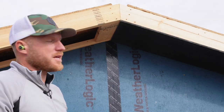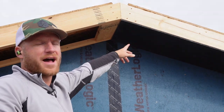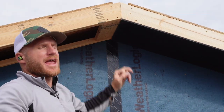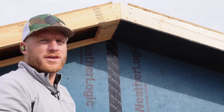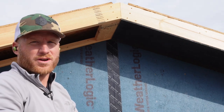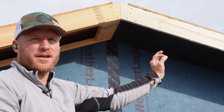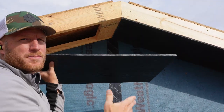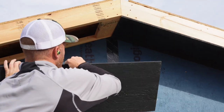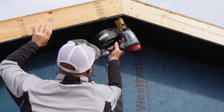Up here at the peak you'll notice we've got blocking on the peak so that both sides have a good nailing place. I'm going to go ahead and just butt the two pieces together and then we'll put a bead of black caulk right there. I wasn't going to miter the pieces because you don't really want to go too tight with them anyway, so I'm going to leave them just slightly gapped. Do your best, caulk the rest - am I right?